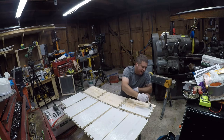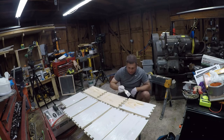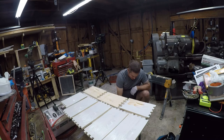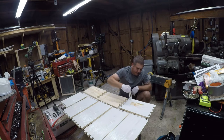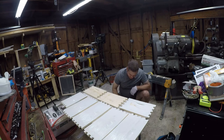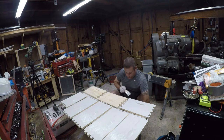At one point, I had to paint an outbuilding, and so I went in there and I bought the cheapest crap they made because I frankly didn't think it was going to be around for long. I bought America's Finest, which was, you know, pigmented water by comparison, a real thin paint. Sprayed it on. That paint outperformed everything else on the property because the wood siding would absorb moisture and release moisture, which is what wood does. And in doing so, it would stress the paint and pop it off the wood.